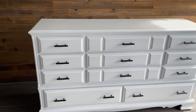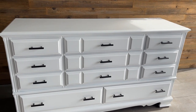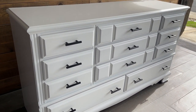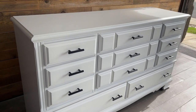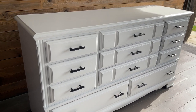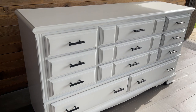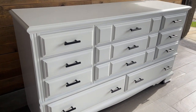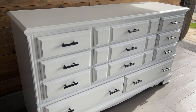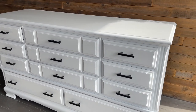Here is a piece that I just completed in the Enduro White Poly. I get a lot of sunshine right now on my staging area, but just so you guys can see the sheen — it's a satin sheen, which is what I chose. This is going in a kid's bedroom. I did about four coats. When you're spraying, the Enduro is a really thin product so it goes on a little bit lighter. I did not prime this piece as it's not a bleeder whatsoever and I had no issues with coverage. This is what the Enduro White Poly looks like on a piece.